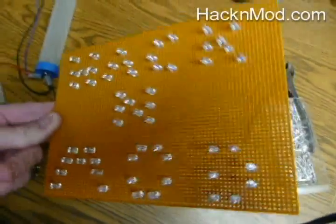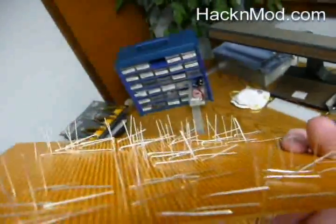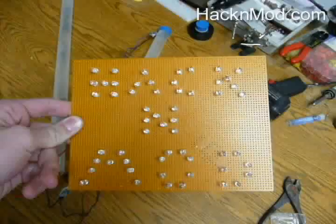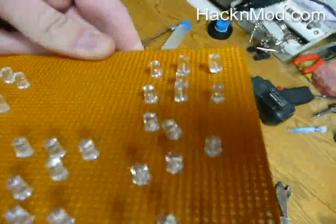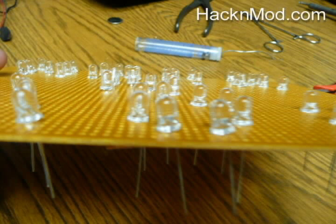Hello and welcome to the HackinWild.com LED Sign Tutorial. The first thing you have to do is put all your LEDs in a perfboard like this one I got from Radio Shack for about $4. Put them in, make sure all your positive and negative leads are put in properly, and then fold back either the positive or the negative — just make sure you keep them straight.